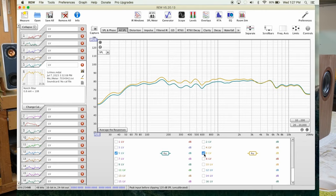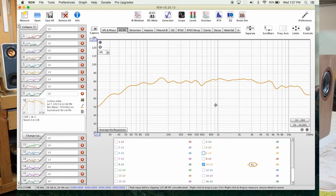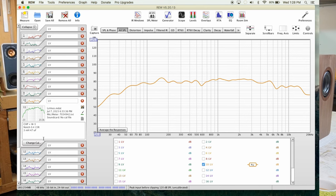And I added a notch filter. Okay, that's a notch filter. Guess what? It lowers a little bit and our curve's getting somewhere in here. So we added a notch filter to the full range so we can control those mids a little bit, okay? Because it was annoying. It was summing with the woofer, with the subwoofer, and it was annoying. So I wanted to control those high mids, which is like 1K, 2, 3, and high frequencies. So that's where we are.